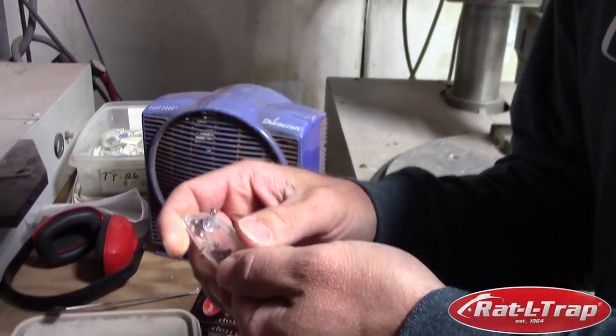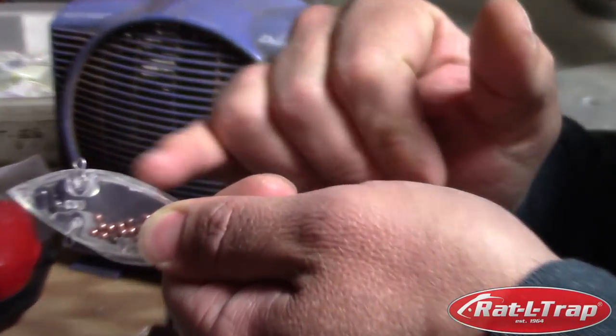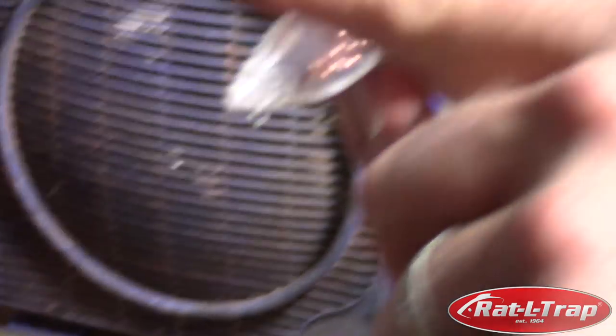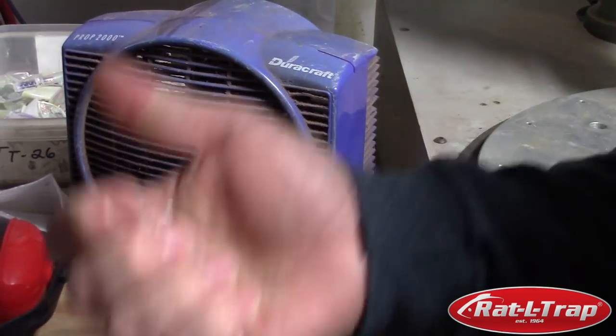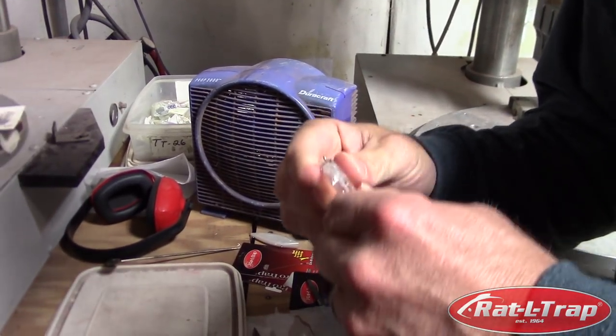The things we'll look for is maybe some flash. Sometimes the plastic will get squeezed a little bit heavily and you'll have a little overhanging bit coming out, and so then we'll have to adjust the settings. But it looks like these ran pretty smooth — the machine must be set really well right now. So now they're sonic welded. Even if you have a 10-pounder grab a hold and try to rip it apart, it's going to stay together real well.